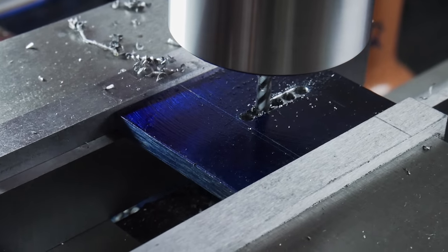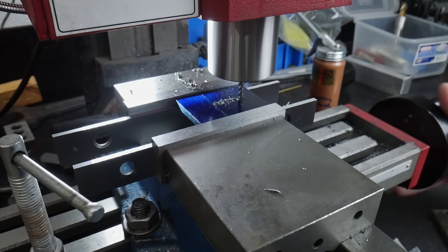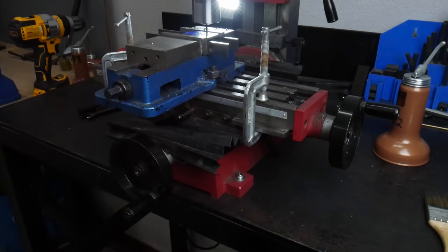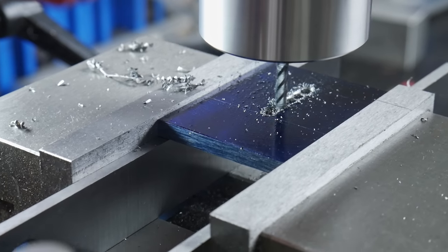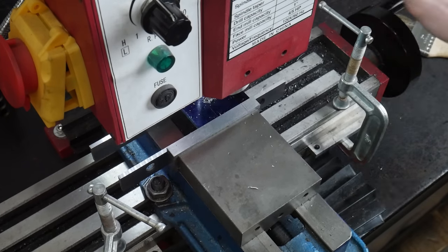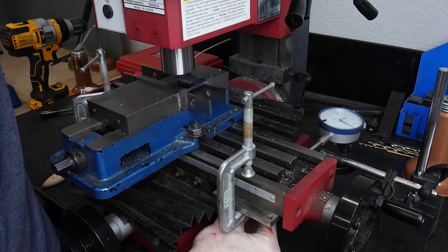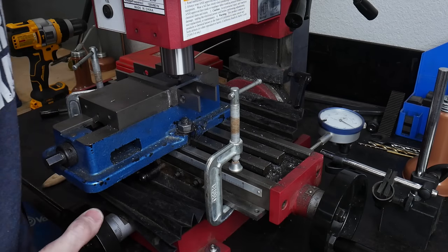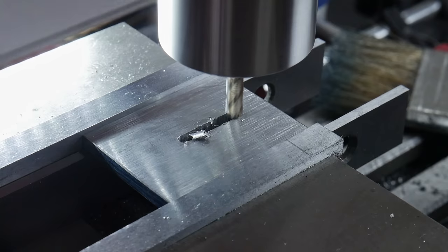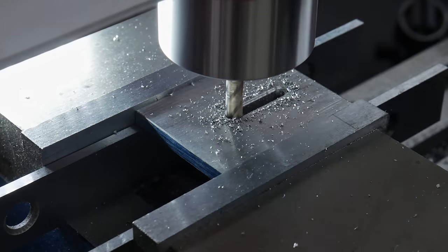I'm working on the stainless steel guard for this Bowie — putting an 1/8-inch slot with an 1/8-inch end mill, then bringing it up a little larger to about 130 thousandths to match the thickness of my ricasso. Having the mill for this operation is really nice — you get a great starting spot for the slot. If you're really good with the mill you can mill this almost precisely to your ricasso thickness and be done with guard fit-up quickly. I'm not quite at that level — I went just a hair too large on the slot, leaving an ever-so-slightly small gap.